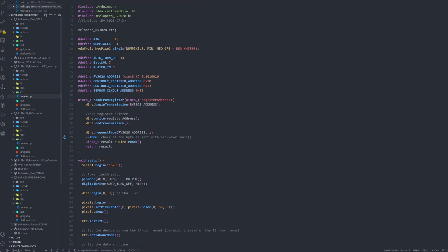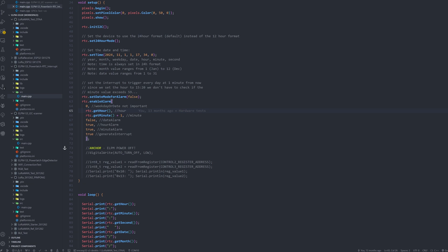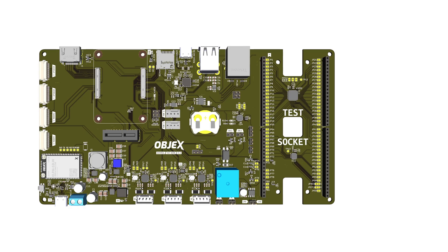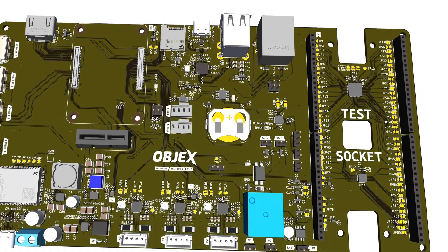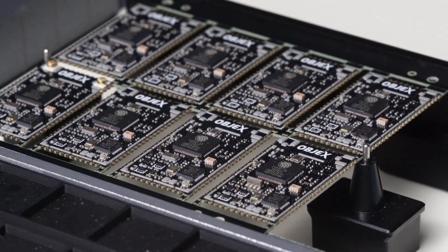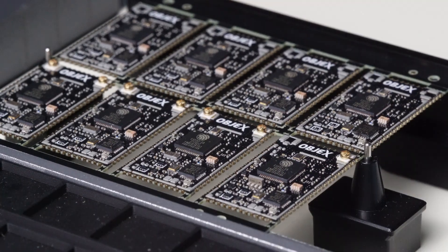This testing part absolutely needs to be automated because right now it acts as a bottleneck. Even though we've managed to automate the first part of LPM production, we now need to resolve the entire final production stage before packaging — which is testing. We've developed a testing machine based on a CM4, so a Raspberry Pi for now. The idea is simple: the LPM is inserted into the socket and all tests are automatically executed, instead of me manually loading firmware every time. This automation is absolutely essential for being able to produce hundreds of modules every week. Please also visit ObjectsLabs.com.